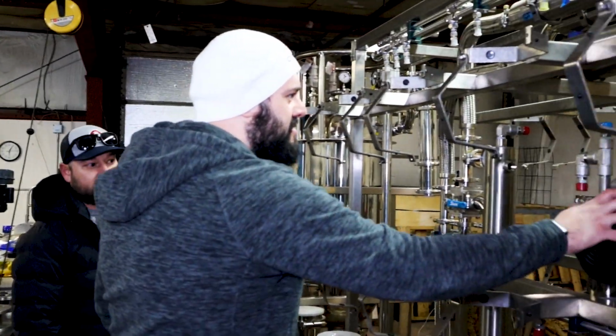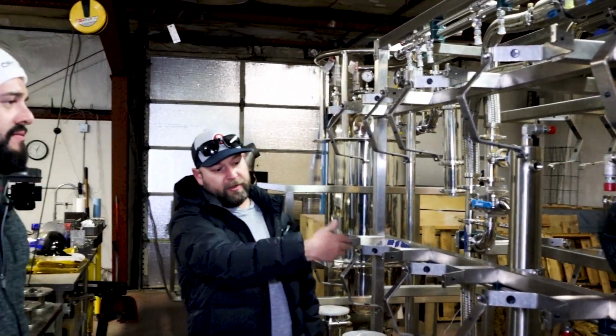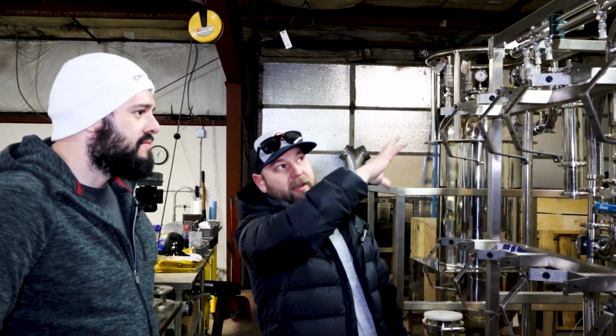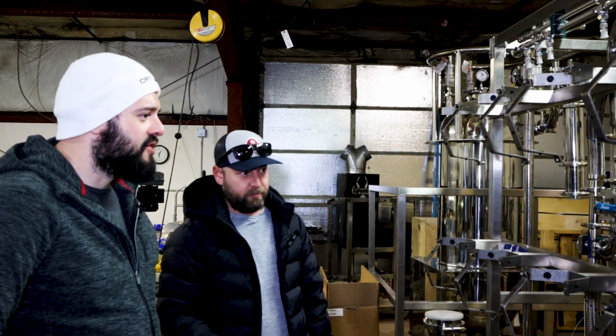That's smart. What is this guy here for? That's just a vacuum pump. It's manifolded to the whole system. So here, after you change your columns, you pull back. Everything's hooked up, so you can run every zone and pull back on the entire system from there.